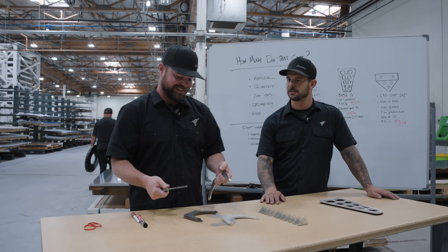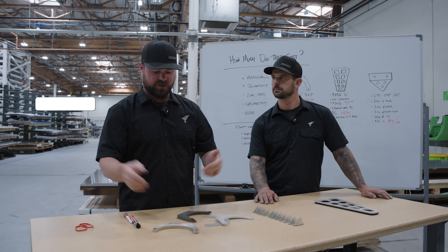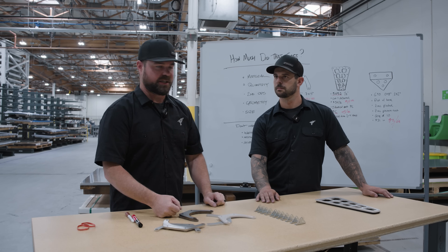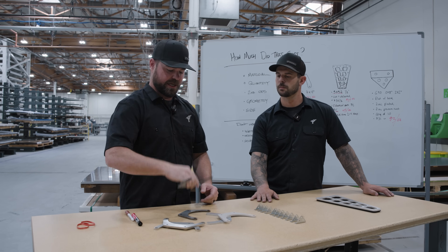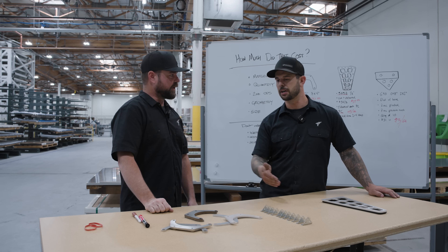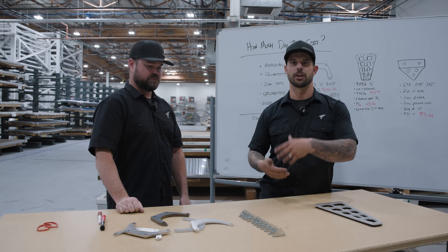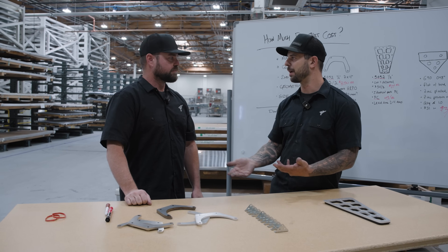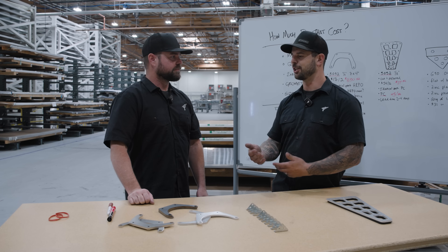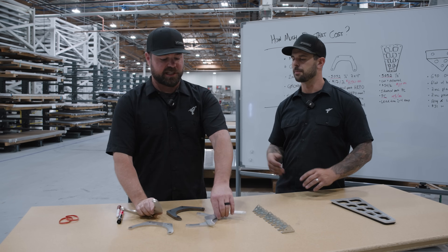Last one - 304 stainless steel. These were about $12 each. Just to show you, even though stainless is a more expensive parent material overall, similar cutting time on each - it's not a big deal when it's simple geometry like this. It goes back to the material properties you need for your project. If it's going to be an outdoor barbecue covering a countertop, you're not going to want mild steel without doing some kind of top coat, which you'll pay extra for. So you might save on the initial material going with mild steel over stainless, but then you're either going to be painting it every single year or replacing it every year.